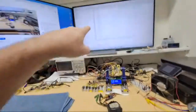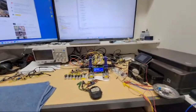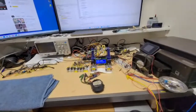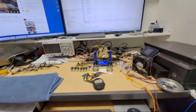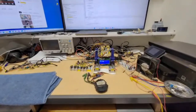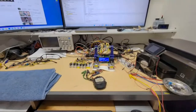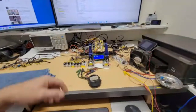And then the one thing I haven't programmed in here yet, which I do have programmed in the other one, is when it finishes the cooling cycle, it was saving that EXV position and then opening to the last one. I might have taken that out. I think it still worked even without it, but I don't know. But that's generally the way they do work in the real world, because you think if you're just going to come back on in 5-10 minutes, the conditions aren't that different. So just start where you left off and start making adjustments. But for this thing, it's been pretty good. And then with a fan motor too.